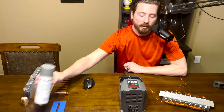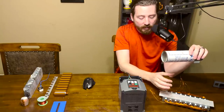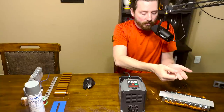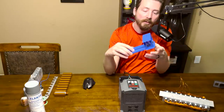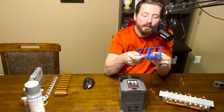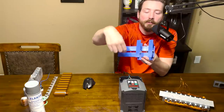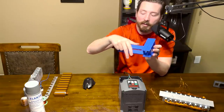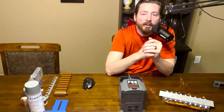When I was winding the motor I was having some trouble. I started out wrapping coils around something round so you could pull them off and put them in their spot, but these slots are rectangular, not round. So whenever I was putting the coils on I had to bend them by hand, and trying to get four corners bent perfectly out of a circle is just nearly impossible. So I went through AutoCAD and designed some little parts that work together - you widen it out to the size you need, tighten it down, and then you can wrap rectangular coils. Whenever you pull them off and go to put them on the motor core, they fit really nicely because they're already the right shape.